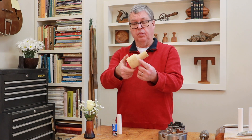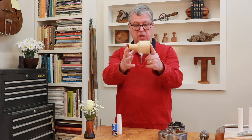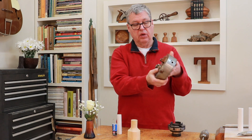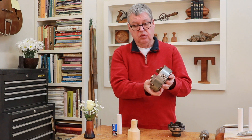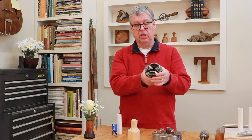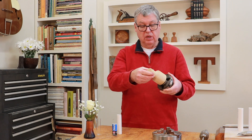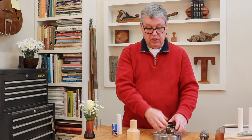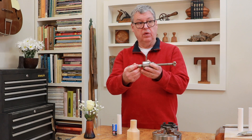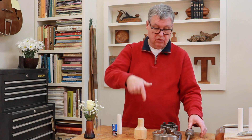And then this is the blank of wood — this is actually bass wood. I prepare this piece to look like this so that I can chuck it into one of my chucks. This is kind of a specialty tool; it's a machinist chuck. This is specifically for woodturning — this is called a Nova chuck. And that's so when I turn it around on this end, I have something to grip onto. You need these kinds of devices so you can bore the hole from your tail stock, which is better than trying to hold it and drill it straight with a drill bit.